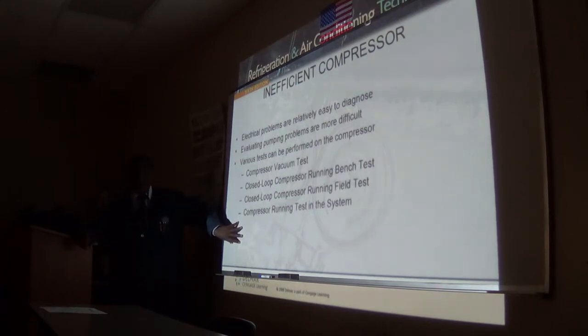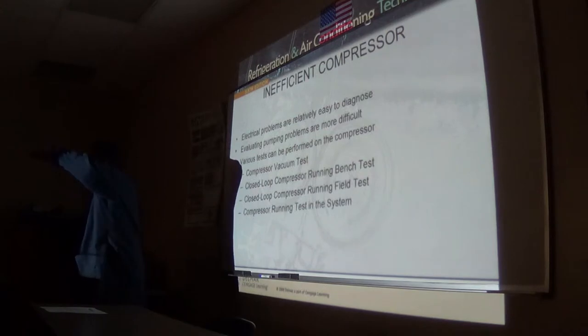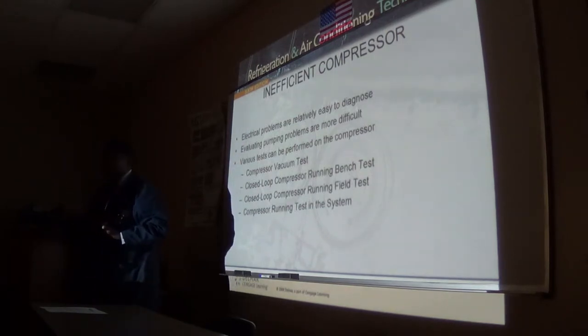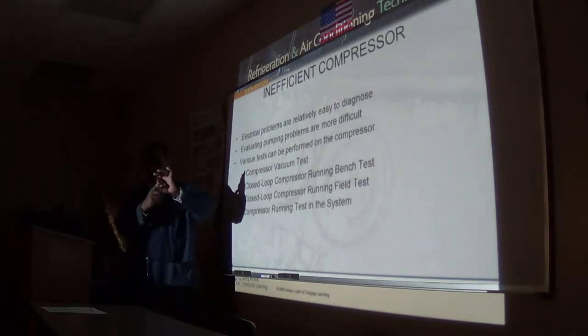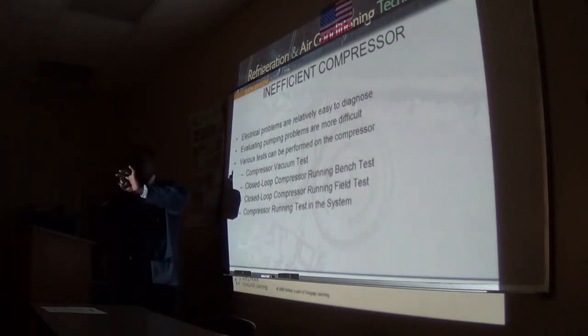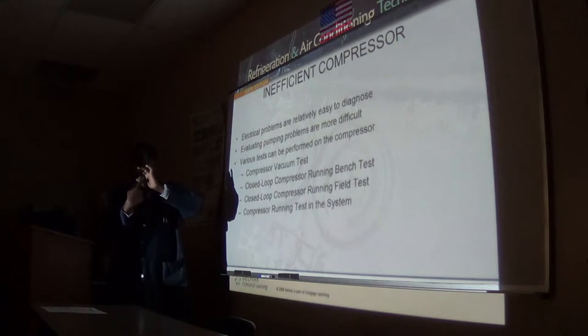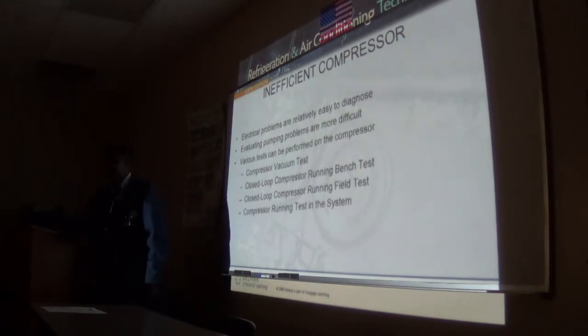Because at 3600, if a little piece breaks off one of those fan blades, it's going to shoot right into that coil and puncture right through and through, or it might hurt somebody out there. And those fan blades, guys, they have a hub that goes onto the shaft and couples on there, and the blade is just pressed onto the hub. Right at the point where you press on, it snaps off. It tears.